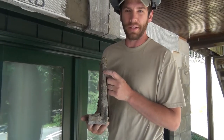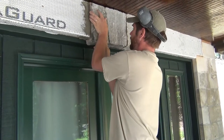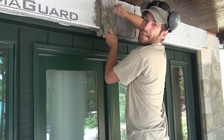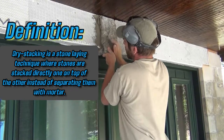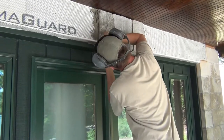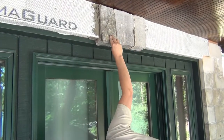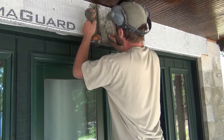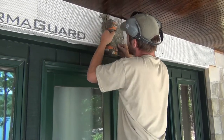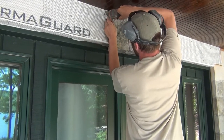We've already pre-made this little toe-screwing notch. I'm going to push this piece out — this is a particularly tight tolerance keystone arrangement because it's dry stacked, no mortar joint. I'm going to put that on there, smush it until we get that nice ooze coming out everywhere, check all of our edges, and then try a left-handed toe screwing. It would probably stay there without the screw, but given all the factors I would much rather have a mechanical connection.